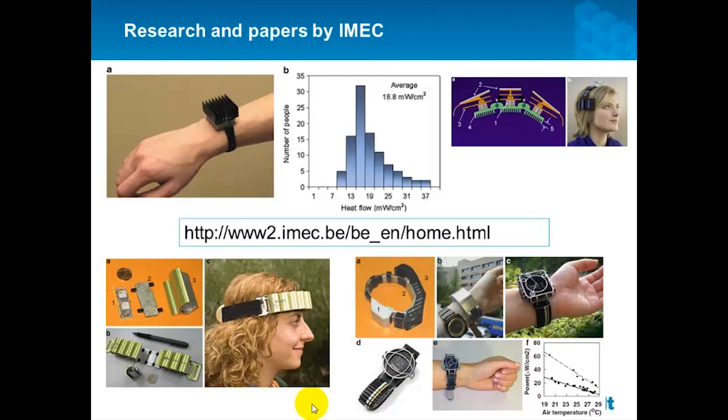But the good, those guys that look at this picture here, the amount of heat from a human body is just maybe 10 or 20 milliwatt, which I can get out of my body. And remember the efficiency story I had. Get 10 milliwatt out with an efficiency of 0.2%. You can already have some feeling of what's possible and what's impossible.